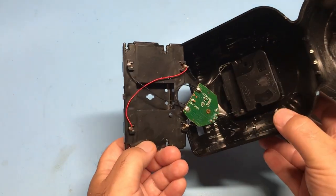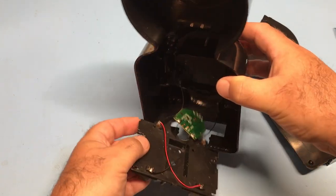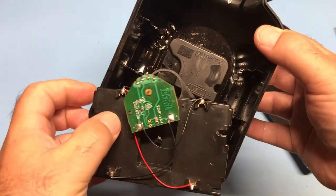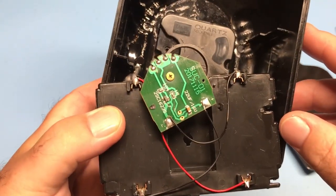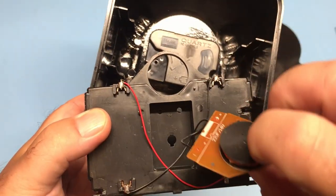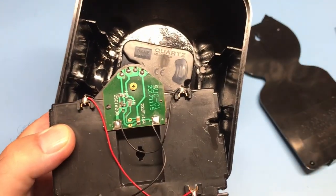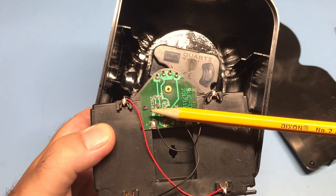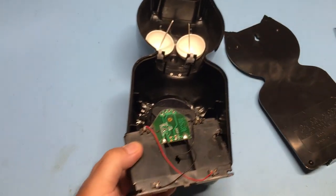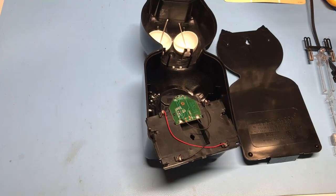So as we turn it over we can definitely see that something went wrong. It looks like the bits of plastic that were holding the circuit board in place snapped off. You can see that one has snapped off. It looks like one side was melted to hold the board in place, and then the other side doesn't look like it was melted at all. And that might explain why the tail animation never worked properly in the first place.